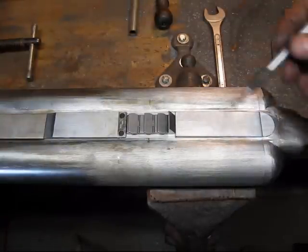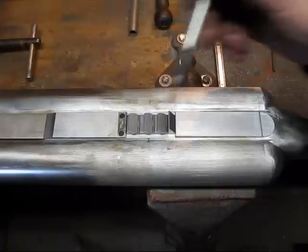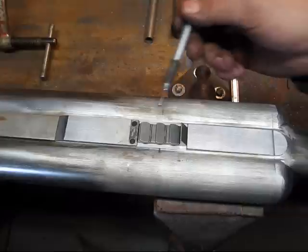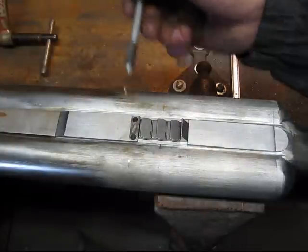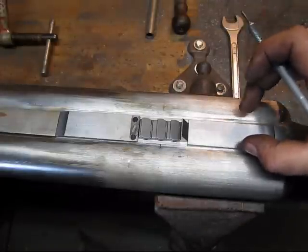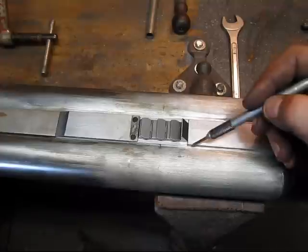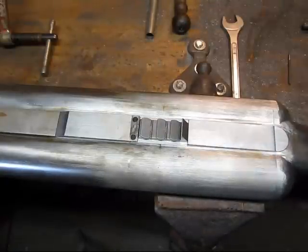There's the quarter rib and the express sight in place, and the little plate that acts as a clamp. Not necessarily traditional on a gun from the 1850s, but not out of place either - I've seen some flintlock and caplock German rifles with a setup similar to this, so it does date back a ways. It's one way to resolve the problem of being below the top line of the barrels. And it definitely locks the sight in nice and tight - it doesn't move around, works real good, and it's real easy to adjust. Loosen a couple screws, put it wherever you want, tighten them back down, you're good to go.